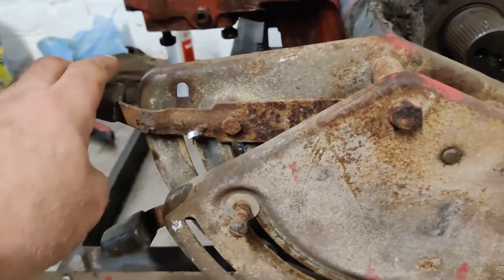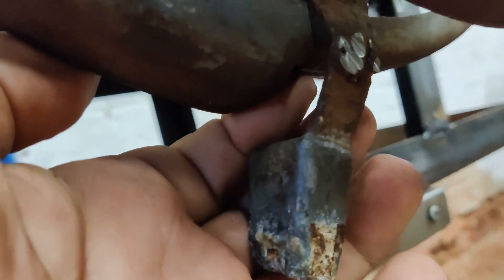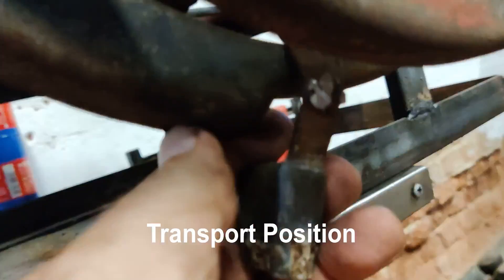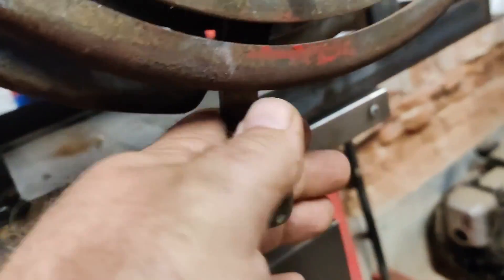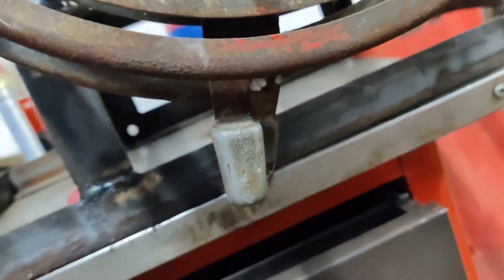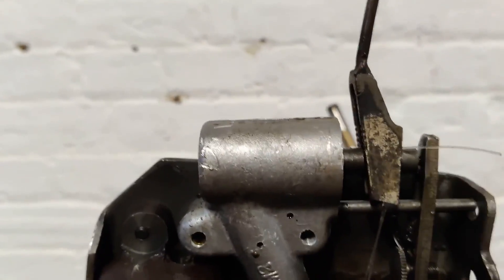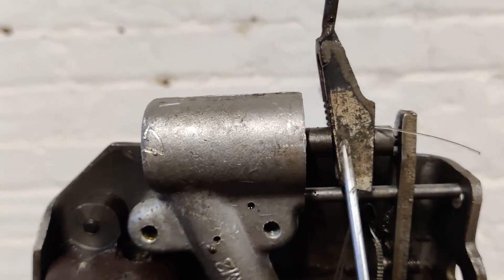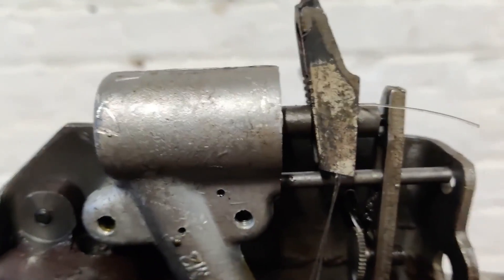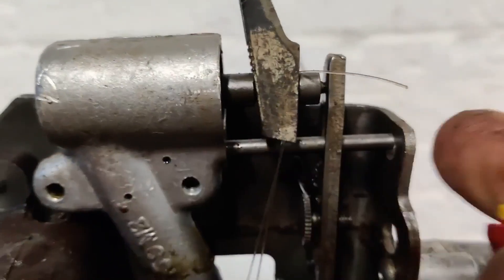So you will put the position control into the transport position. If you've got pressure control fitted there's a lump there — it should say position control stamped where my finger is. Put the draft control lever in between the two quadrant marks and it will appear somewhere around there. Then you stick the dashpot wedge — this little curly chap here — into the dashpot plunger to lock the dashpot plunger as far out that way as it will go, so that dashpot plunger cannot go in and is at the limit of its travel in that direction.